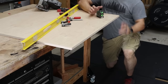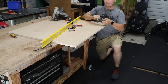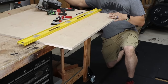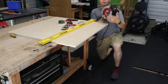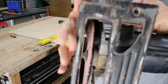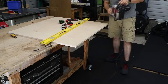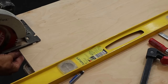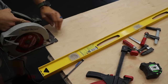Let's say we have a sheet of plywood and we're going to pretend we need a six-inch piece. You'd measure over six inches. Your circular saw shoe — the bottom of it — has a certain distance from the blade. Depending on what kind of circular saw you have, the distance between the blade edge will determine how far over you move the level. If you want to cut at six inches, measure to the inside of that blade and make sure that's where you want it.